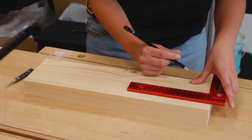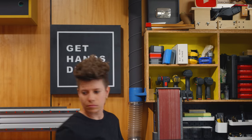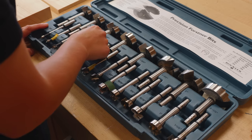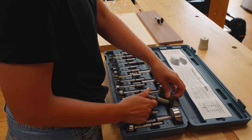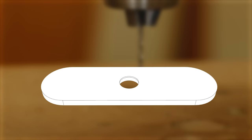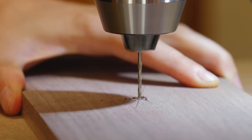I will also drill a couple of holes for mounting screws. I got the precision Forstner bit set from Rockler and started selecting which ones I'd need. The walnut cover will be drilled with two different sized bits — one slightly smaller than the other — so the socket's rim gets covered. That's why I started with a tiny hole to serve as a center point to drill from both sides.